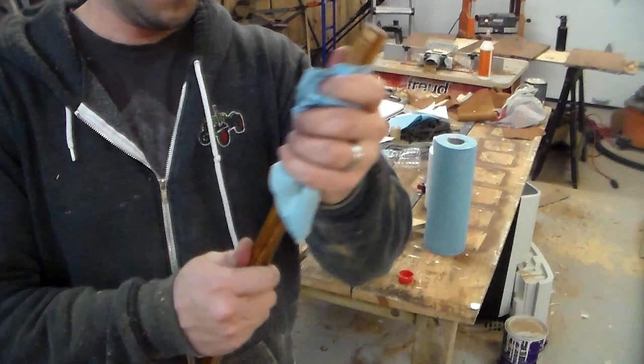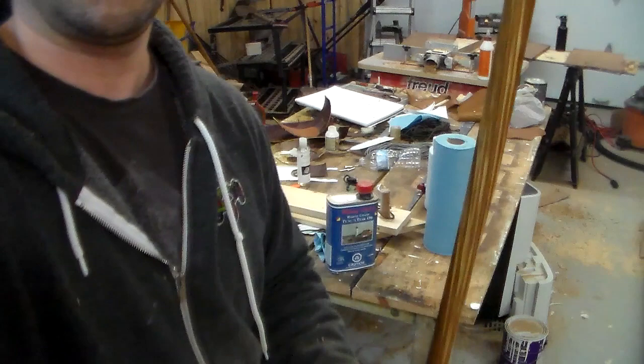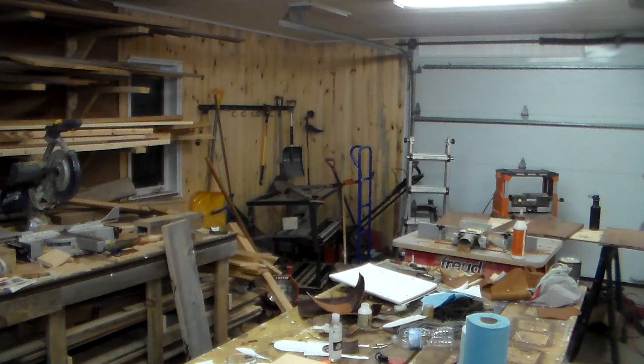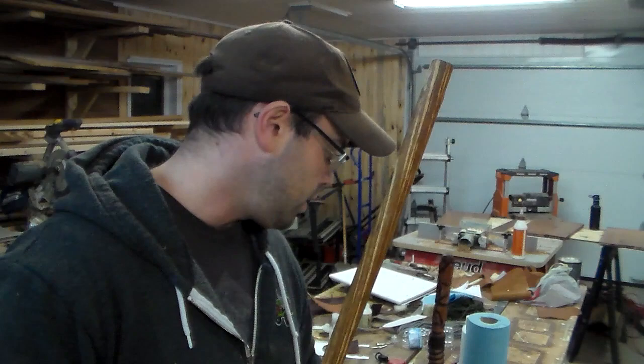So basically that's done. Once this dries, I sand it down with some steel wool, just between the coats — it'll be about three coats of this oil. What I'll also often do is, kind of like this other walking stick we made for the Mike Barton challenge, I'll take just a leather lace from a work boot and wrap it around, or find a way to make a handhold — even just at the top part as an ornament. I do these more for the look, so when I give this as a gift or sell it, people seem to like the leather look.